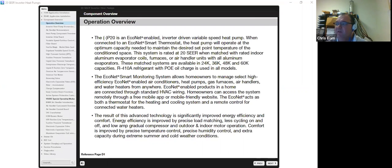The RP17 and both RP20 and RA20 have an overdrive feature. This is available in summertime if it's over 100 degrees, or in wintertime if it's below 30 degrees. Just because the temperature threshold is met doesn't mean the system will go into overdrive, but that capacity is available. The overdrive feature allows the compressor to ramp up past normally acceptable RPM limits — in some cases up to 6,500 to 7,000 RPMs — to achieve more cooling or heating than normally expected.